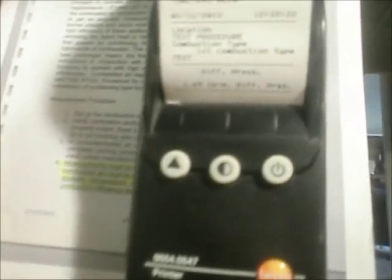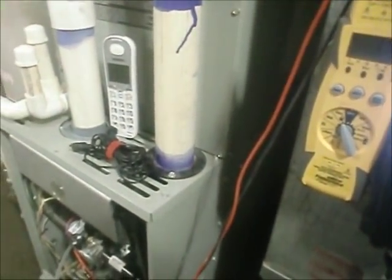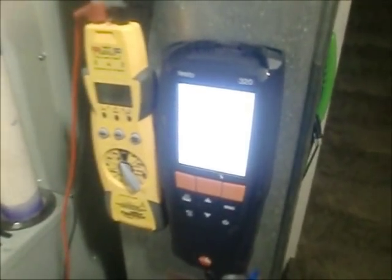We should see Rochester's Heating and Air, Location, Test Procedure, Combustion Type — First Combustion Type Test. We're doing a differential pressure test and we have 1.65 inches of water column, confirming that our pressure switch is functioning properly. It'll just say 'differential pressure,' so what I'd do is mark it as 'pressure switch,' 'gas valve,' etc. I'll try to keep an open row when doing differential tests so I can write something down. Hope you enjoyed this short video on the continuing series of Testo 320 functionality — thanks for watching.